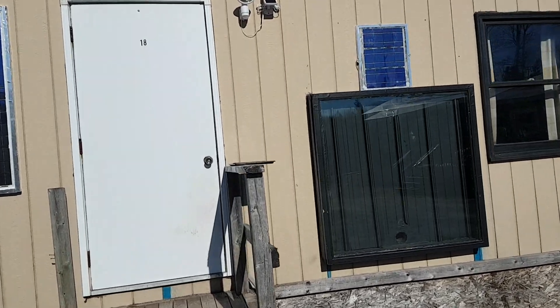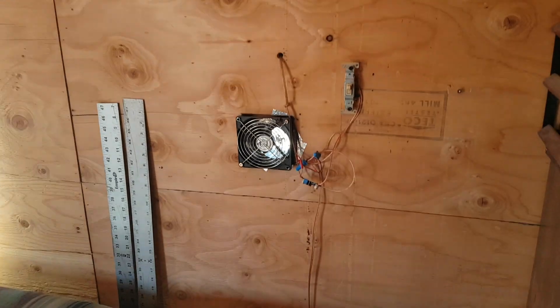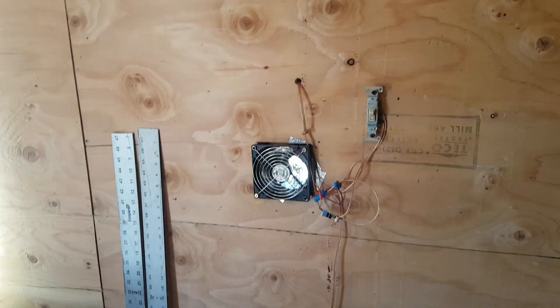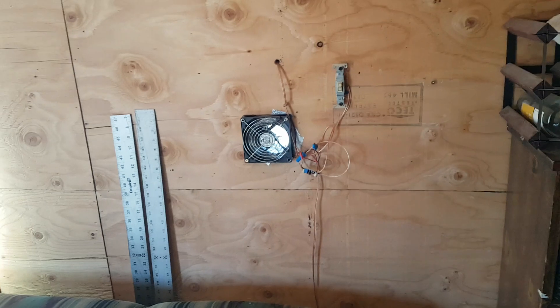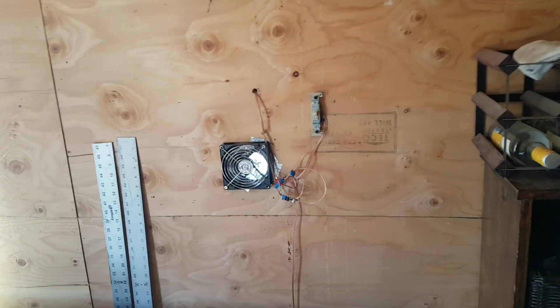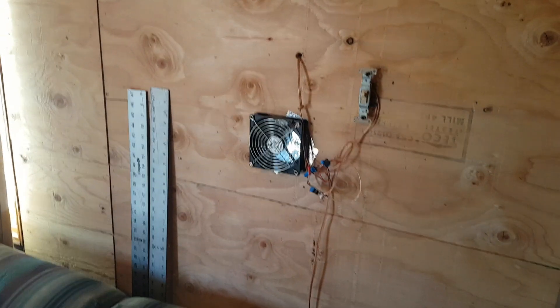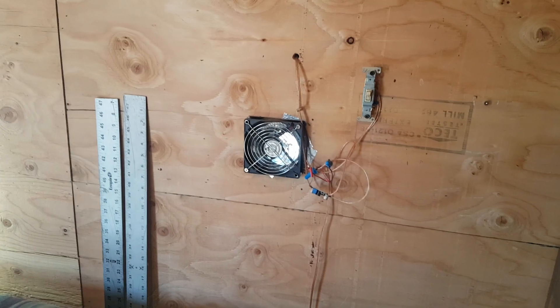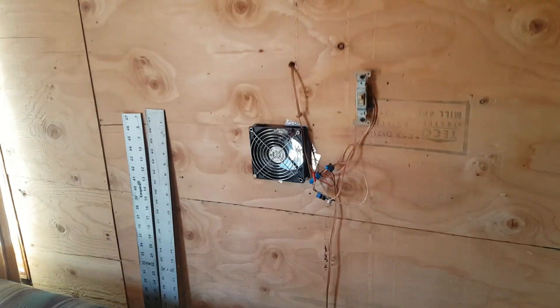It's all reclaimed material on the man cave. Two of these are probably equal to about a thousand watt heater. This is the off-grid man cave — I had it given to me for nothing about eight years ago. It was an old lunchroom they were going to discard. Here are the fans inside running well. The problem with this build is this end has a three inch vent port on top and a three inch port on the bottom — it sucks in from the bottom and exhausts from the top. They work great but the fan doesn't stop running. The other end has four inch ports and that one seems to cycle on its own.